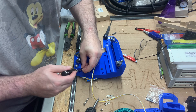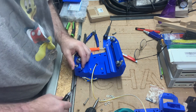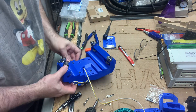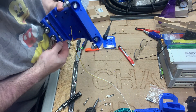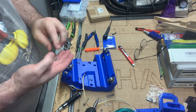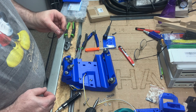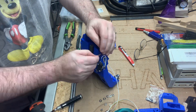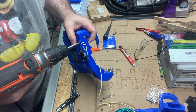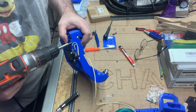I think I can get one in sideways — it's just a question of whether I can get it straightened once it's in, and that is really not a given. After trying for a few moments, I don't think I can get one to go in sideways and then turn it straight. It also looks like the screw length needs to be a 25 instead of a 30, because the screw would actually come out against the 608 bearing.